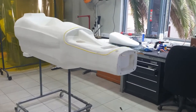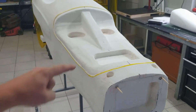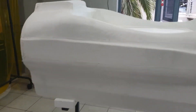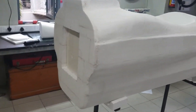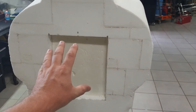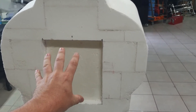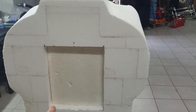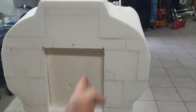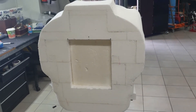So what we've now done is we've done all the cutouts as you can see there — inspection hole, inspection hole. We've cleaned up the entire tub to the best that we can for this particular stage. We're obviously going to be putting a bladder fuel tank inside of here, so giving ourselves the space to work. We want the edges of the tub to be nice and clean, so once this is finished we'll have a slight angle for the mould, just so that we can take the finished piece out of the actual plug.